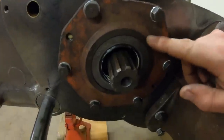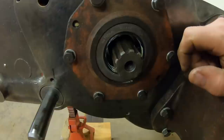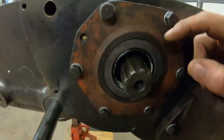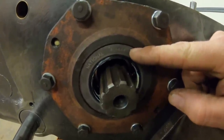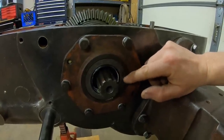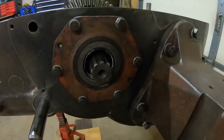One more thing that I just about forgot to mention, I'm not going to replace these brake drum seals at this time because these are not that old and they were absolutely dry when I took it apart. These are some very heavy National brand 416-444 seals. They're a very heavy duty, durable, fully encased steel body seal. Highly recommended for this application.